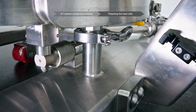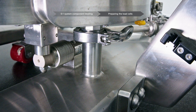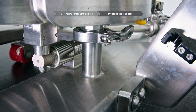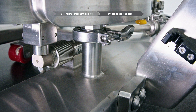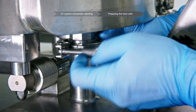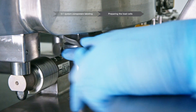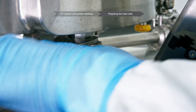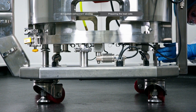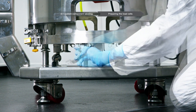For HiPerforma 5 to 1 SUB hardware units purchased with factory installed load cells, the load cells are shipped in the locked position, threaded up, for equipment protection. To unlock the load cells, remove the tri-clamp. Loosen the lockout nut using the small end of the supplied spanner wrench. Repeat this process for each load cell until all of the lockout nuts are disengaged from the lockout posts.